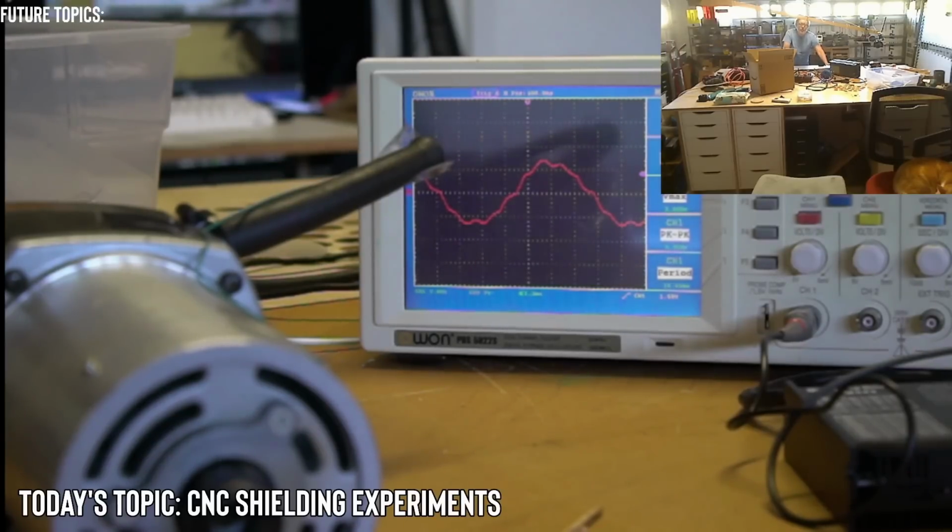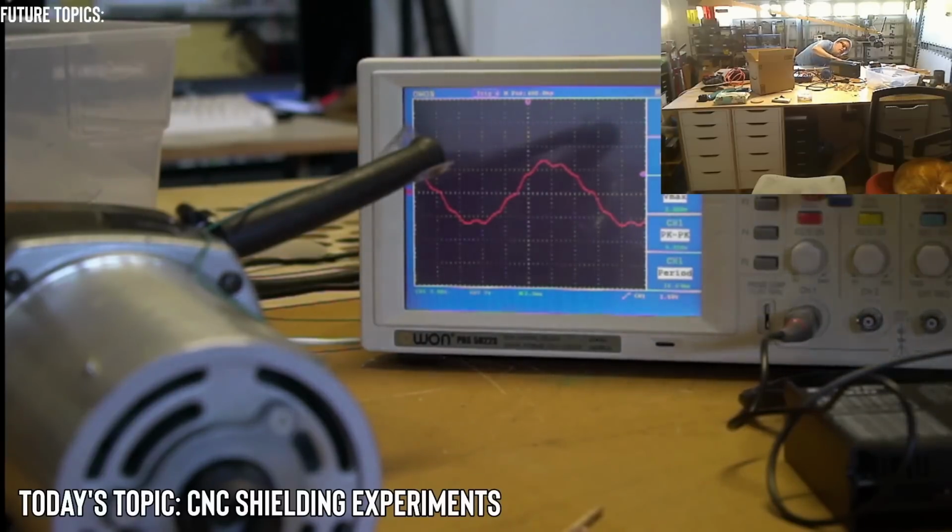We're doing lots of dangerous things right now. I'm putting load on a router to see if the load affects the signal. And what we've found is load definitely does. And it seems to create a spike that does get up to about 4 volts. So plus or minus would be 8 volts. So the peak to peak is actually 8 volts. So I'm going to do the test again at 5 volts right here.